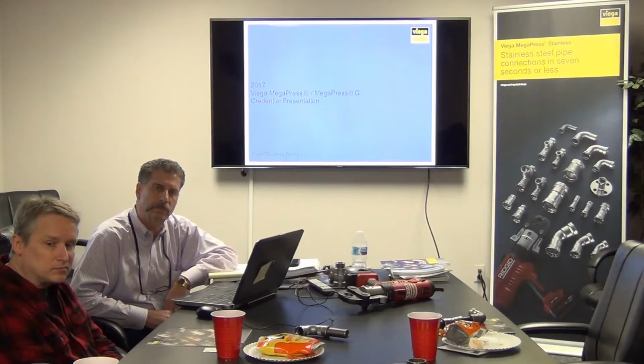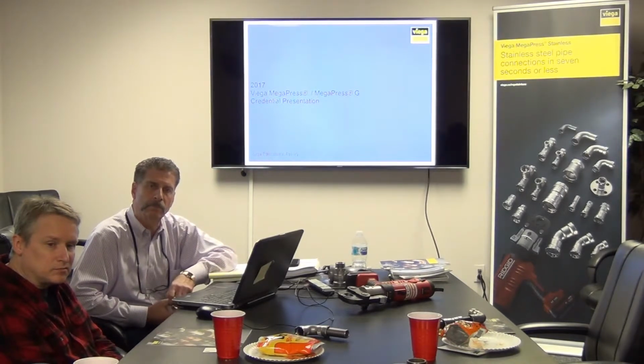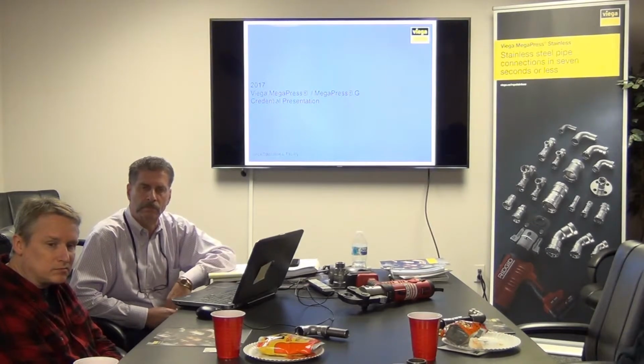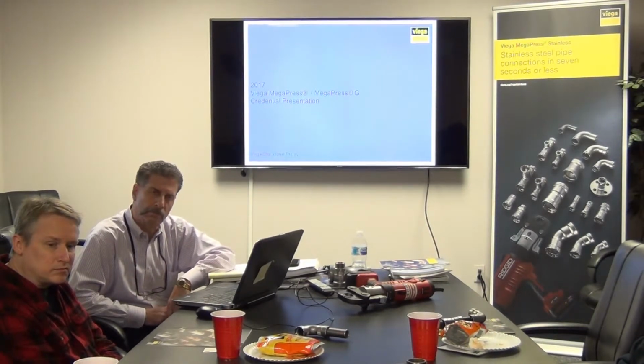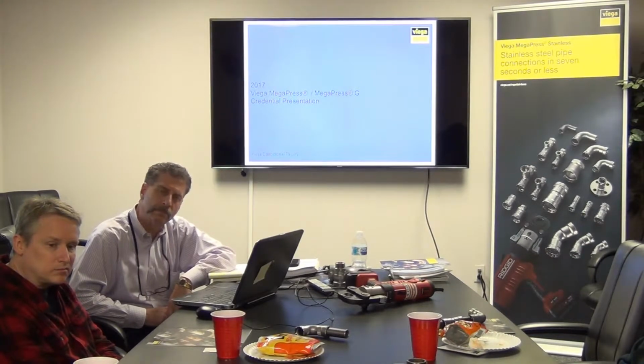That's up to him. If he knows it's on a condensate return line, it's not aggressive, pressures are 80 pound, he knows it's going to work. It's his system. So I would say to him, it's not an approved Viega application, Sked 80, but if you want to do it, it's your system. Right. A lot of guys aren't concerned about that.